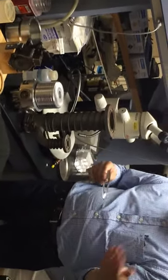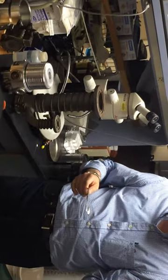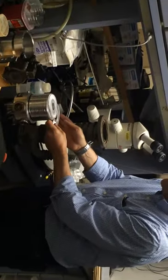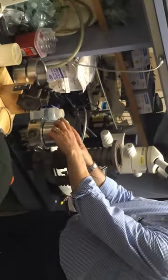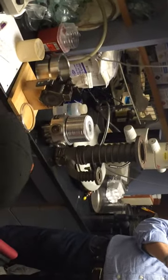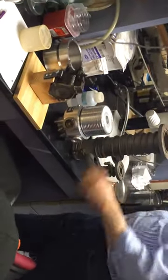They went away from oil bearings because they didn't want oil in your system to then contaminate your microscope column. So they went to magnetic bearings. As long as you don't hit it or something, if it goes side to side and hits the wall of the chamber, then you're toast — especially when you're talking at 90,000 RPM.